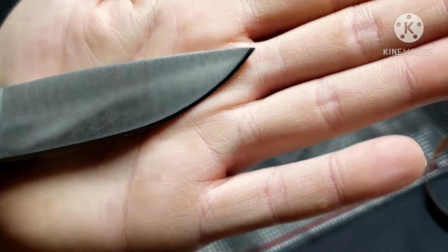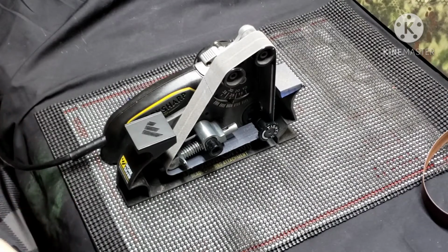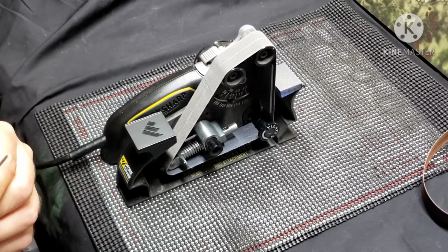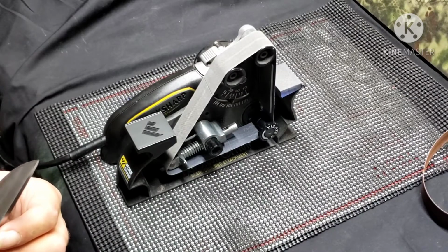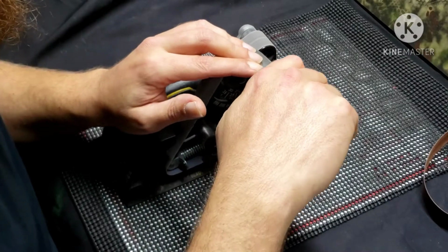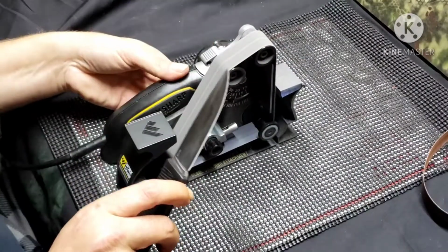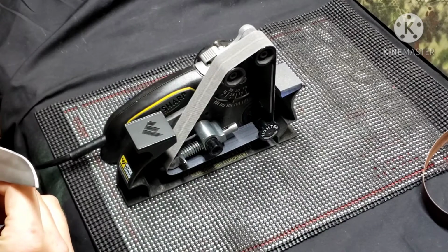And of course, we're not done, obviously. But it's coming along. We were able to even out the grind on the tip there. Kept it pretty symmetrical all the way around. We've got majority of the 120 scratches out. Might need to give it just a few more though. Alright, I think I'm pretty well satisfied with the 220. Yep, I'm satisfied with that.